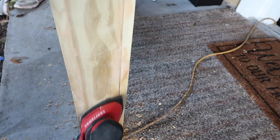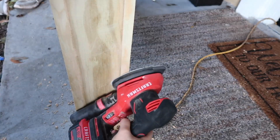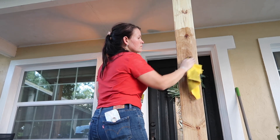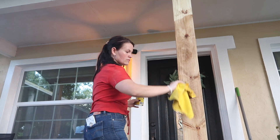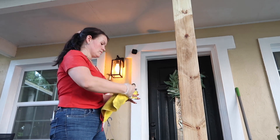After the end of the first day I used a little bit of wood filler, sanded it down to test it out, and I'm going to test out some stain to make sure it's what I want before I go to the store and purchase more. The color I'm going to use is Special Walnut by Minwax. It is an awesome stain color — I think it's just a beautiful classic color and I highly recommend it.